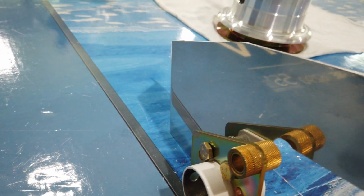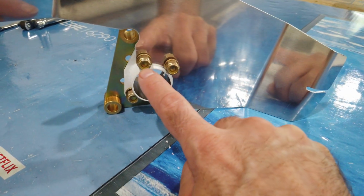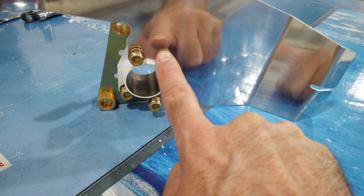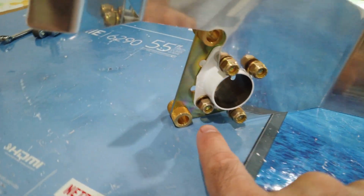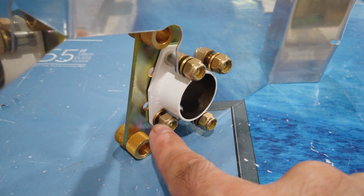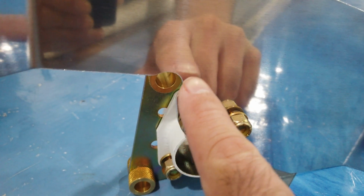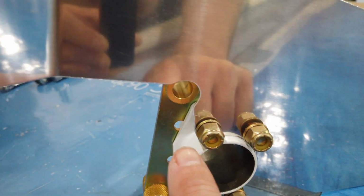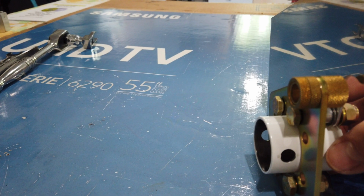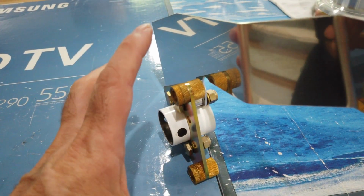Spacers are only on 3 points. If I spin this around, remember the bracket wraps around here, so there's a spacer under these 3 long bolts and potentially washers, and this is just a shorter bolt. The bracket obviously does not come around to this bolt, so this is a lot shorter. And again, the cutout here, this corner cutout for the caliper to slide through nicely. So this is the appropriate orientation. You can see the through hole here in relation to the rest of the setup.